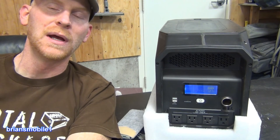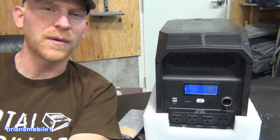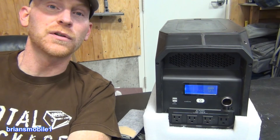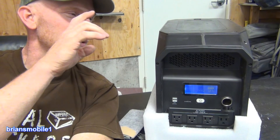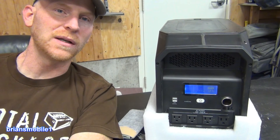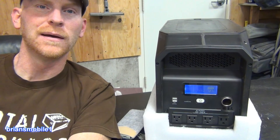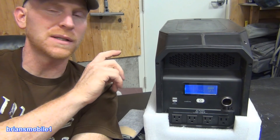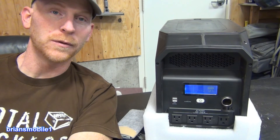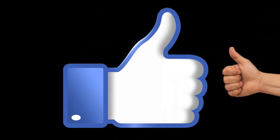The long and the short of it is this is too heavy and not portable. I bought this because the box checked all the boxes for me — it said ideal for solar, ideal for camp. Then I figured I could use it as a backup power supply in the meantime. It's so heavy it's not portable, and the pulse width modulation solar controller means it's only charging on half the time, essentially. By the time I paid $500 for this and $160 for my solar panel, I could have got any number of setups that would have been a lot better for portable use. That's what you need to know about the Duracell PowerSource 660. Thanks for watching — be sure to click like and subscribe.